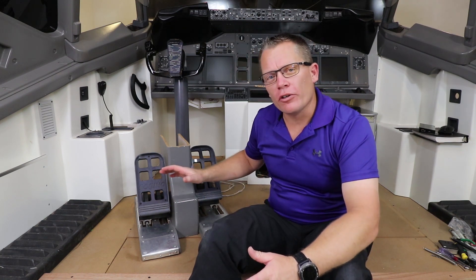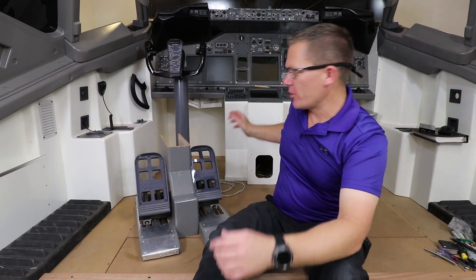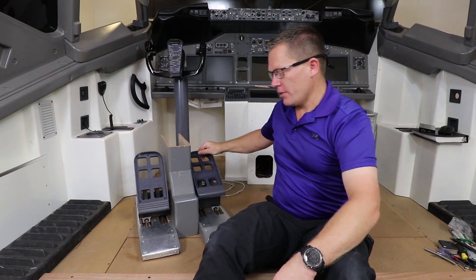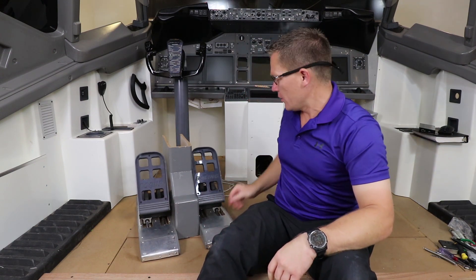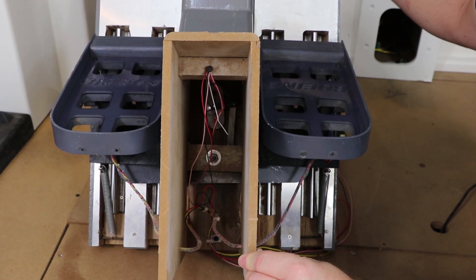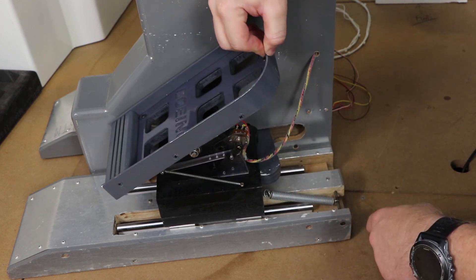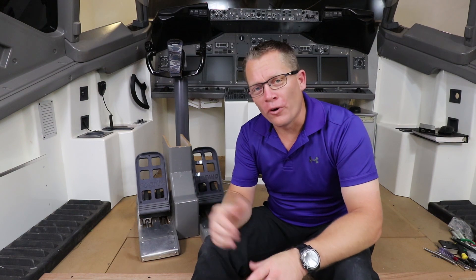With the yoke complete it's now time to look at the rudder pedals. These are version 1 — my original sim. They were designed to fit what I call the baby sim, but going full size now these are too small. However they work exceptionally well. They've got differential braking left and right and interlinks backwards and forwards. They ride on CNC rails and I've used the pots from the old yoke assembly. Right inside at the back is the potentiometer which takes the feed from the pedals, and on the sides of the pedals are the differential brake pots.